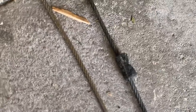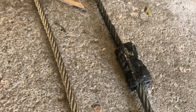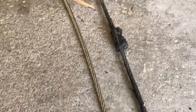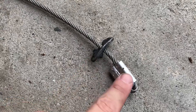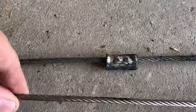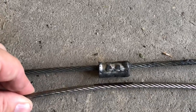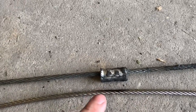To get the stopper bracket off the old cable, we're going to need to cut the cable because we can't slide it off with the stopper in the way. The stopper is the same kind of dual-channel crimp connection, just crimped on one side. I'm going to go ahead and do the end-point crimp. Here you can see the crimp connection is done. Our stopper and pusher are in place. We also marked where the midway pusher or stopper needs to go — I lined up the cables perfectly in length and put a black mark so I know exactly where to put the next crimp connection.